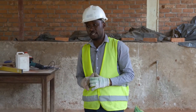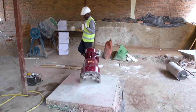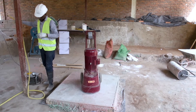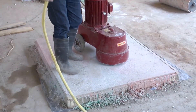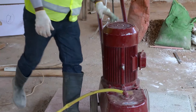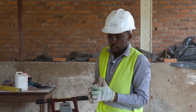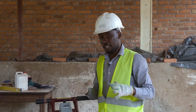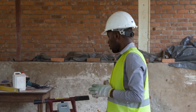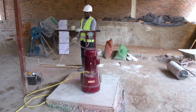One of the instructions for using this terrazzo grinder machine: we have to make sure that the machine is properly connected with a water tap, by means of this water pipe. When the machine is used with a connection of water, this will prevent any fragments which may occur, because when we are grinding, some fragments can jump out. Also make sure that the machine is properly connected to an electrical cable which is not damaged.